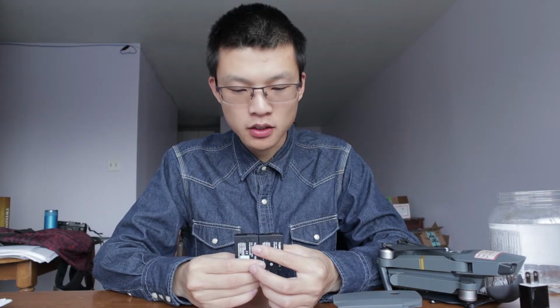Lastly, when you get out during winter days and you want to have good battery to use, charge them up. Just charge them up to a higher state of charge, probably 10% more than when you do in summer. For example, for electric cars, you might charge it to 80% during the summertime. So in winter, charge it up to probably 90% or 95% when you go out. For these ones, you can simply charge them to 100% and you're good to go. That's the talk I wanted to give about lithium-ion batteries.